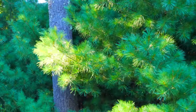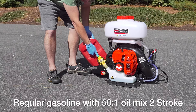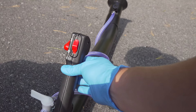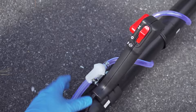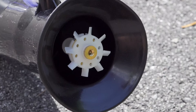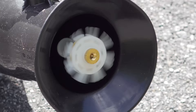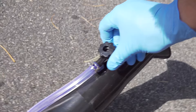This is exactly where my search led me. To fuel this thing up, you've got to use two-stroke, which means you mix gas and oil together — identical to the Stihl. They use the exact same kind of fuel. It's got these heavily padded straps on the unit. They're thick and they work very well, and oftentimes when you get a budget piece of gear you don't always get that. All the controls are right here at your fingertips: the throttle, the on and off, and a throttle lock so once you get up to the speed you want, you can hold it in with that lever. There's also a liquid valve so when you're spraying chemical, you can start and stop the spray. And this is the business end — it can rotate, and when air starts going through along with the chemical, that helps it come out evenly. This valve on the end controls how much chemical comes out. You just pick the setting and you're ready to go.